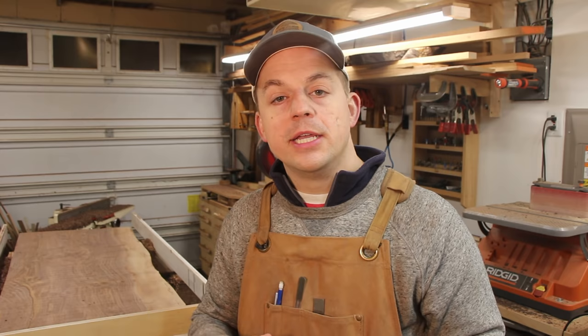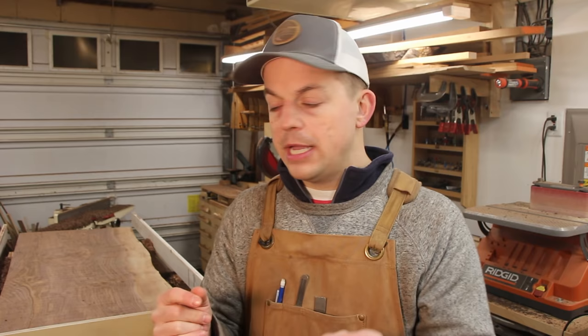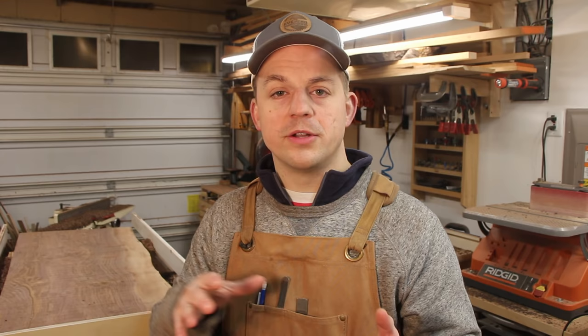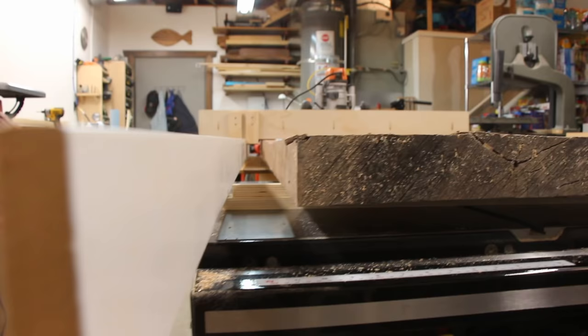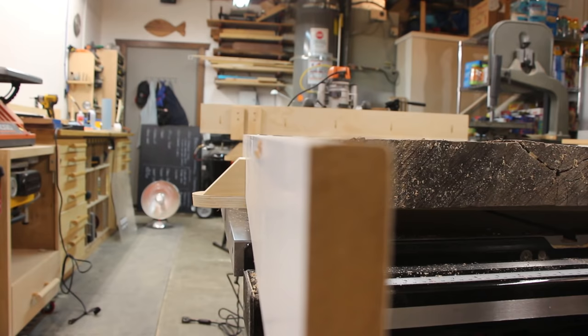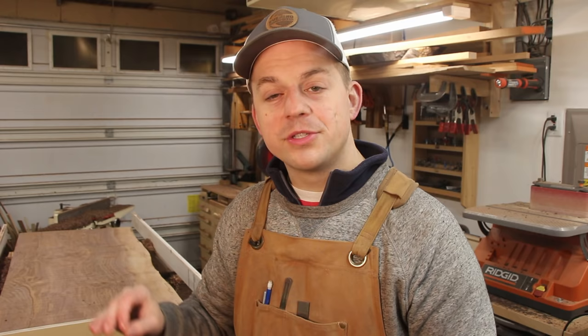The next thing to think about in your design is your rail edge — this is another crucial indexing feature. If it's not square and smooth, all of those variations will translate directly to the slab you're trying to smooth out. You want to make sure whatever you're using for rails is wide enough that it won't deflect when you lean on it or when there's a router riding along it, but it doesn't have to be a huge thick piece of wood. What I used were two pieces of 1x4 MDF trim I found in my garage — the edges are so square and perfectly flat along the entire length that I decided to make these my rails. The critical thing is this top edge, which is your indexing surface.